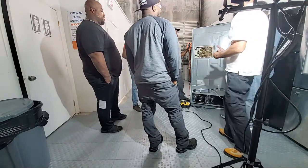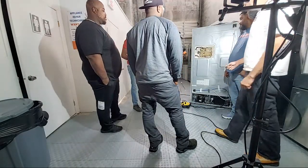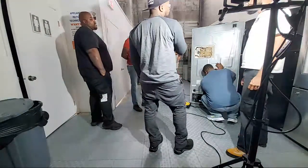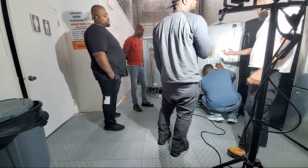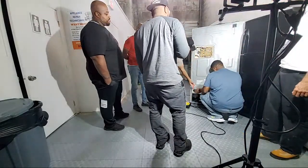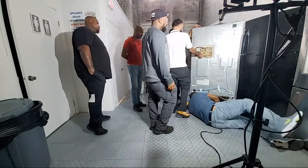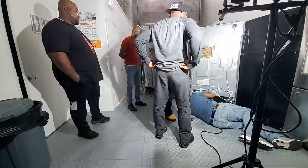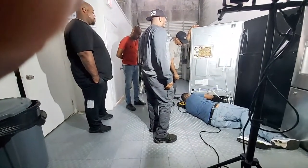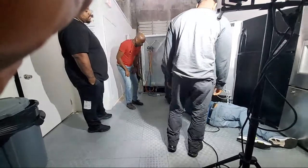Well, let's do that test. Continuity on each wire. Let's unplug the unit. I'm going to have each one of you guys do it. Unplug the Molex down at the condenser fan. Well, you just said you might show gray there. Down there, it doesn't matter. It's neutral. I see what you mean. Watch. We're gonna test from there to right here. I'm looking at this side so I know where to put it. On this side. All right, the wiring color changes.